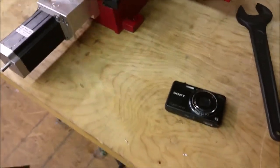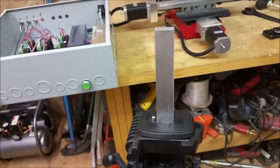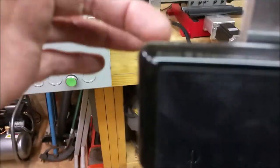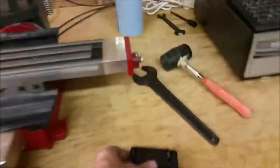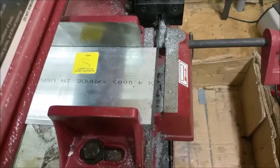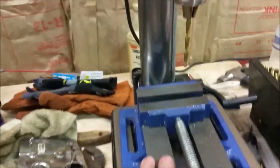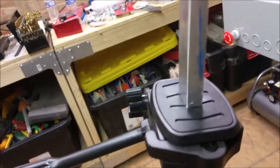The problem is trying to hold it. So what I came up with was this. Obviously it's not totally complete, but it's good enough — you just mount the phone on there like this, and the camera's on the side. But I've got to figure out some way of securing it. All I did was cut a piece off on the bandsaw, drill a hole with a number 7 drill, and tap it with a gun tap — the type you can put on a drill. Then I just screwed it right onto the mount.